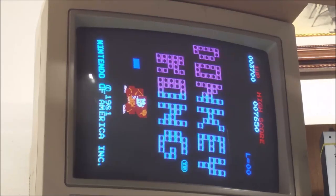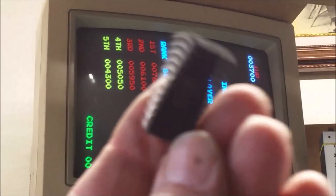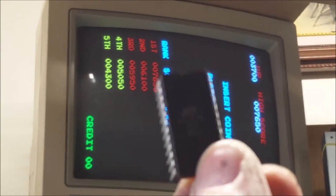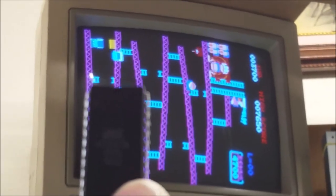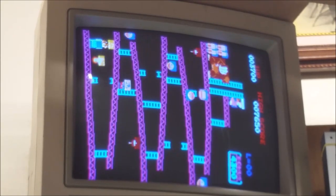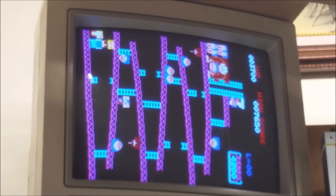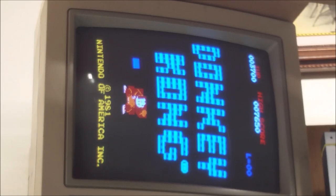I had a heck of a time - I've got a tube of these Atmel chips. These are electronically erasable and programmable - they're all 28C16s. They work great but I had a whole tube that was just bad. That one's still not any better. I've been having fun trying to find one that actually will program. I'm going to load 7C and program it.